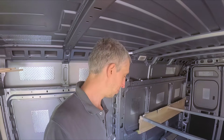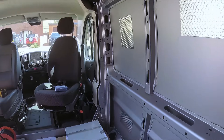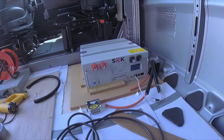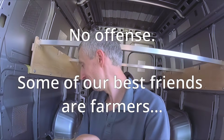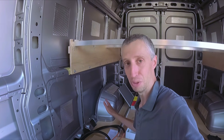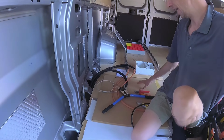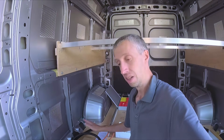While I'm waiting for all the stuff related to the bed platform to set, I thought I'd work on the electrical system. Some of it's temporarily installed. So this is the giant lithium battery — 48 volt server rack battery. It's going to go there, but installed in a slightly less farmery fashion. Over here is going to be where the lovely blue box expensive thing — the Victron charge controllers, inverters and all that kind of stuff — is going to go. I'm going to mock up all of the Victron stuff on the floor here so I know how much space everything is going to take, and then start wiring things up.